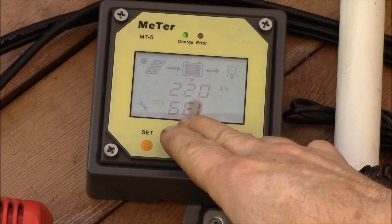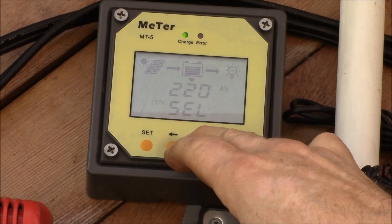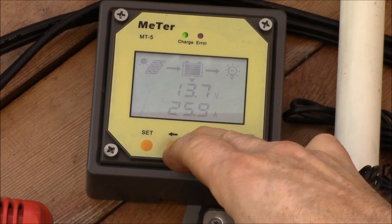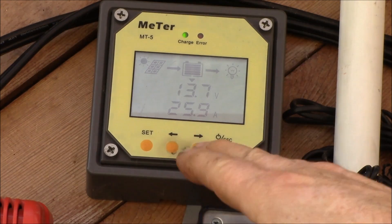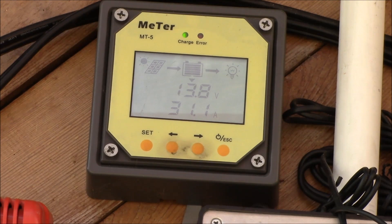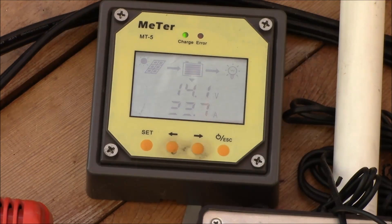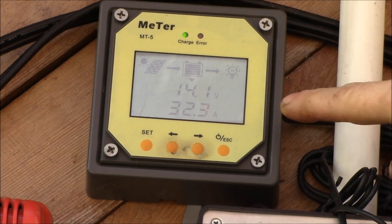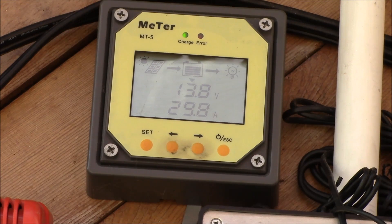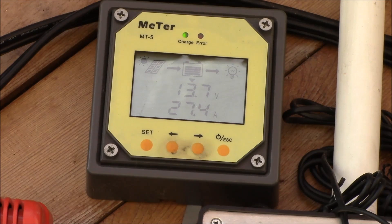So what I do is leave my battery type on gel cell for 29 days and then switch to sealed lead acid for the 30th day. Now if I set that, the charge controller will go through an equalize cycle sometime today — you can see it's already jumped up to 14.2 volts. Over the course of today it'll probably do a couple of equalize cycles as the sun comes and goes and the loads go on and off.